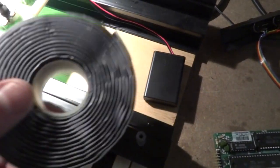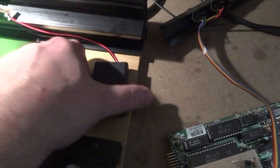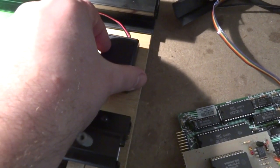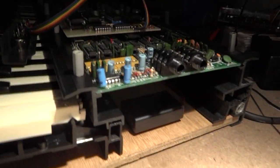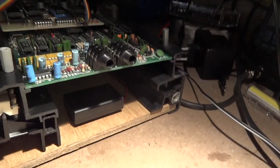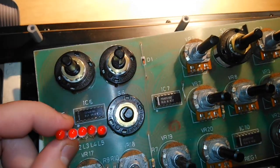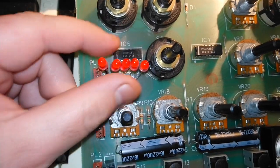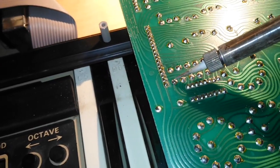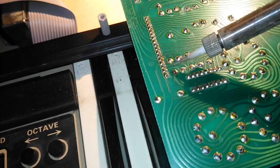That might not hold up to touring but it will work well in a studio. There are battery holders with screw holes so you can screw them into the bottom if you're crazy enough to take this vintage synthesizer on the road. Here's the battery holder in its final position — you can easily reach in and change the batteries by just removing the right-hand panel, much easier than before. I also noticed this lead was wiggling; it turned out to be because it had broken loose from the solder on the backside. This at least is a very easy fix — and there, it's done.